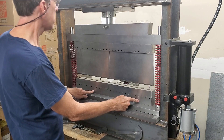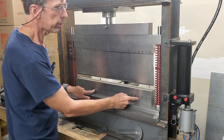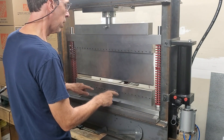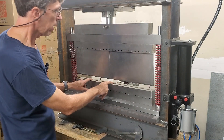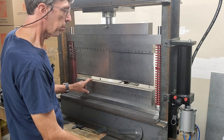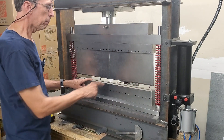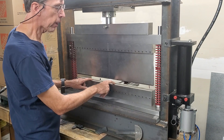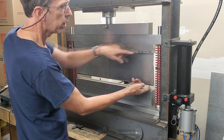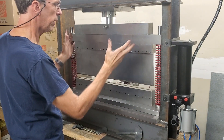I've got four die holders — American style, basically 1 inch wide by 5/8 inch deep. I've got two dies here. These dies are made for 18 gauge material. They're 3/8 of an inch wide opening, machined at 75 degrees. The punches are also 75 degrees — these are 8 inch long punches.